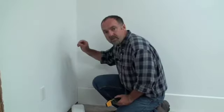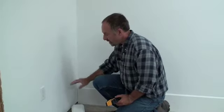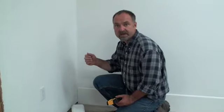But one way or another, they're going to let you know where the stud is, and you mark that spot at a point just above where the base rail is going to go, so you know where to drive the nails.